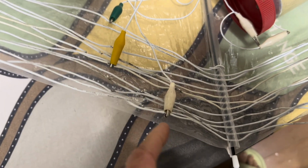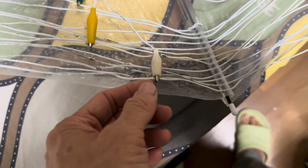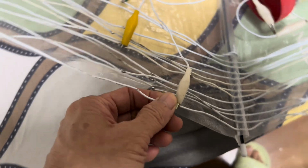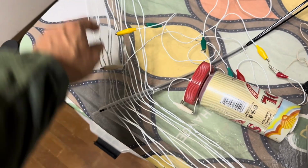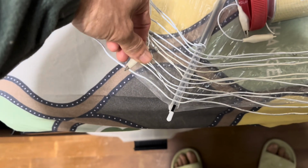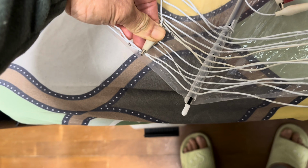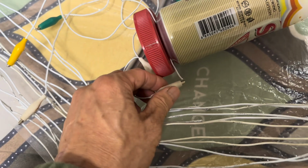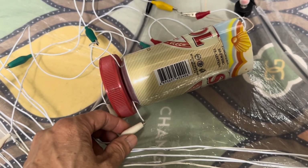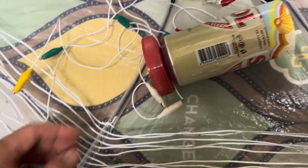Let's start with the hot end, the white alligator clip. So one end connects to the most outer turn, that is the turn with the largest diameter. Starting from that turn, you can clip your alligator clip to contact this contact point, and the other end you connect to one of the 2 terminals of your beer can variable capacitor.